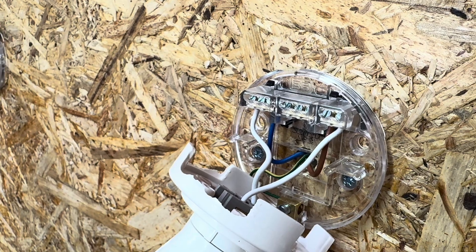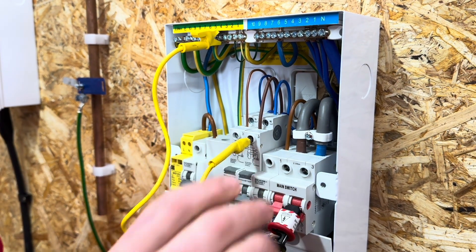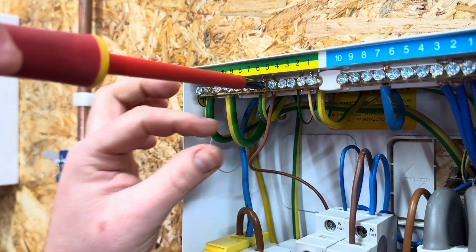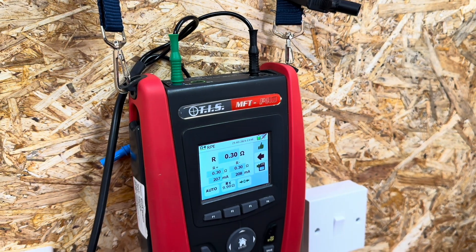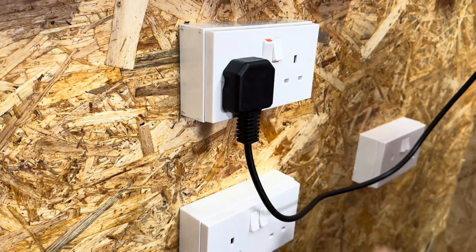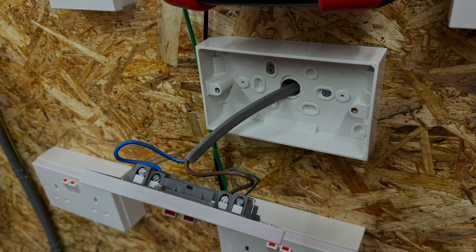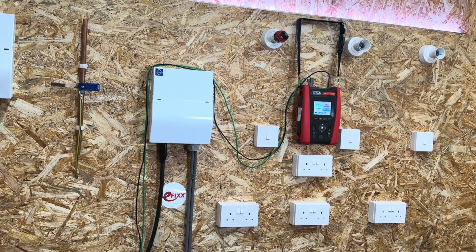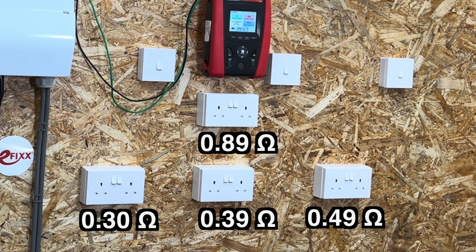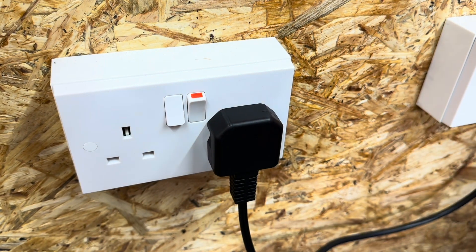I will do the same at all the lighting points and switches — not just to get the highest reading, even though this is what we record, but to verify that the protective conductor is electrically sound at all points in the circuit. Having tested at all my lighting points, I take the highest reading to record on the schedule of test results. I then remove my link wire from the lighting circuit and connect it onto the radial circuit. I test at each socket and we can see how the resistance increases the further away we get from the consumer unit, because resistance is proportional to length. The highest reading for this installation was not the furthest socket but a spur off the radial circuit — showing why it's important to test at every single point, not just the furthest.